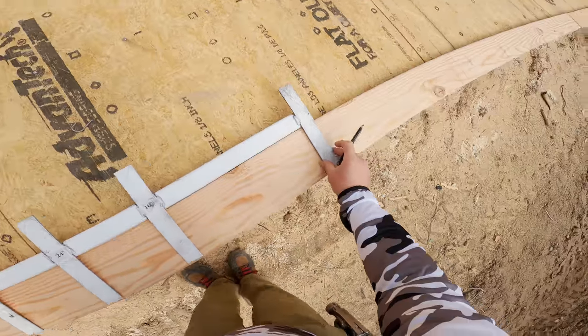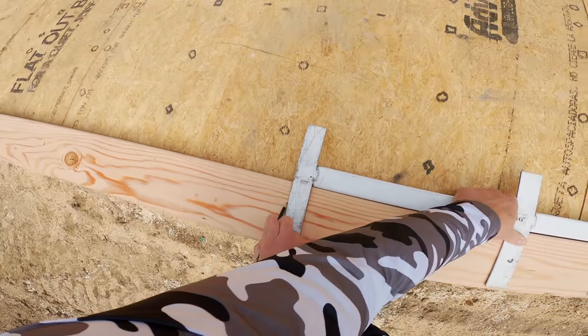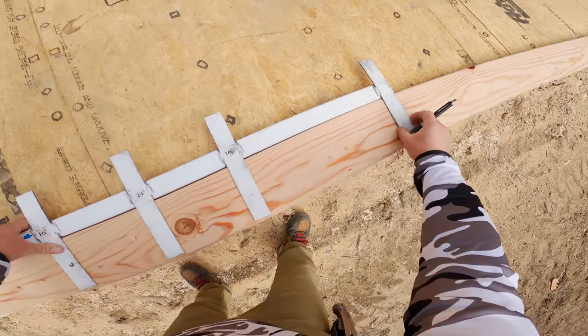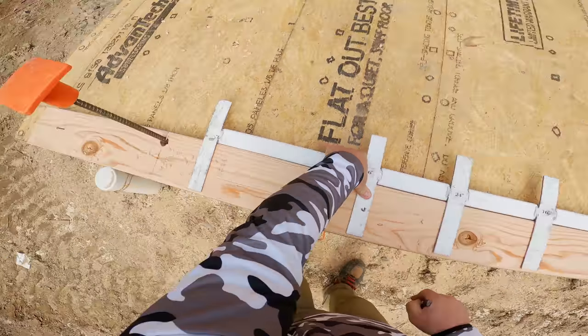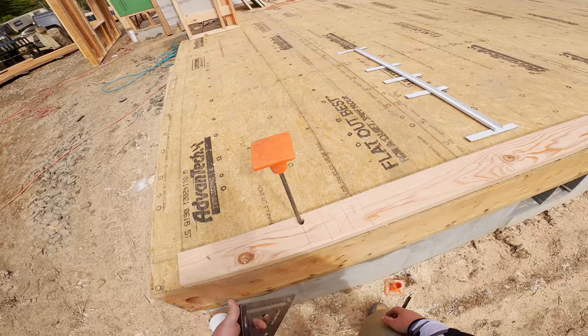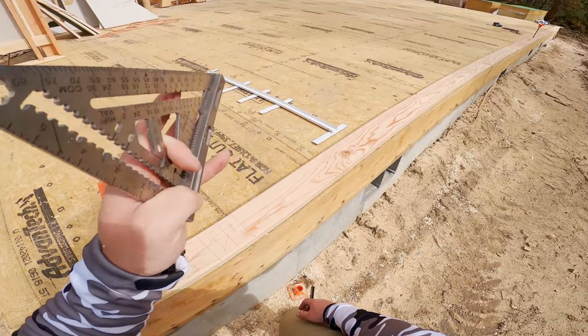So you notice though that we are framing 24 inches on center. That is deliberate. We are using the optimum value engineered framing. Maybe I'll try to put a link in the description. Basically, it's trying to minimize unnecessary wood in a wall. And so we frame 2 foot on center. Just make sure that your studs are straight. We can do that, Kyle.